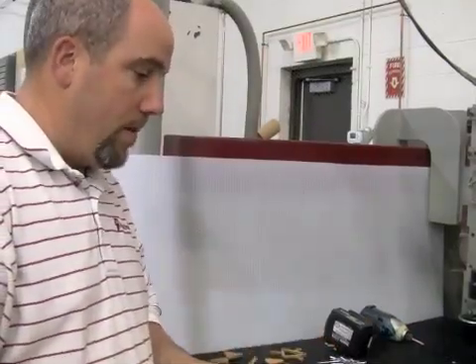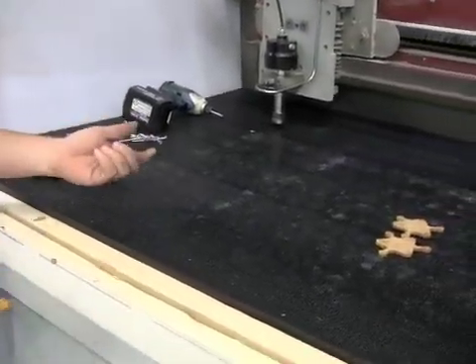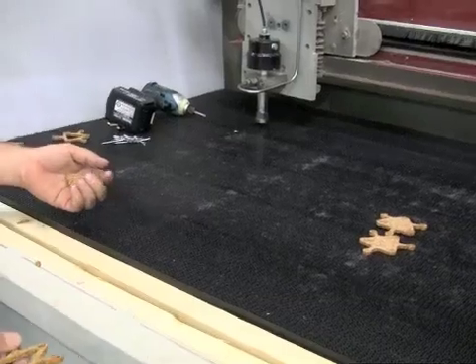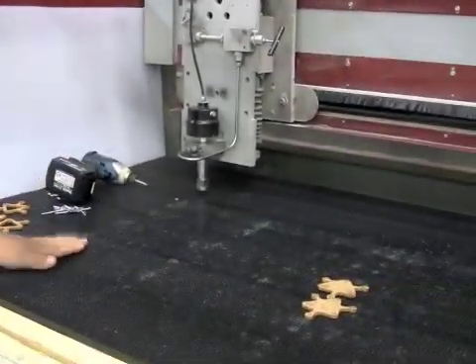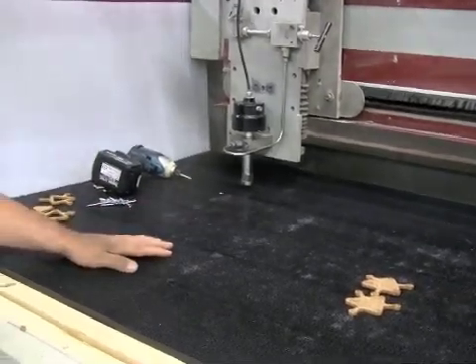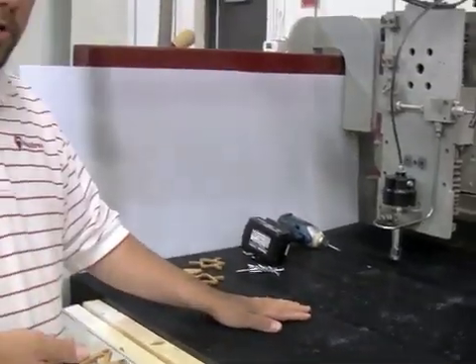As you can see we've taken our sheet off the bricks. What's really nice about a water-only application with the brick is everybody asks how long does the brick last. Of course, like everything in water jet, brick life is a function of what you're cutting and how fast you're moving. In this application with water only, you can barely even see where we ran this part. With water only and not abrasive, we're going to be able to run job after job with minimal wear and tear on the brick, which makes it such a wonderful, ideal surface for water-only cutting.